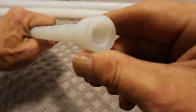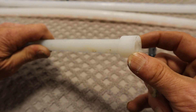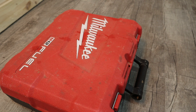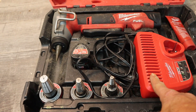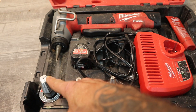You take the ring and push it on until it seats inside there. You can see where the pipe is bumped in — that is your crimp ring, but we're not using a crimper. Now there are different companies that make these tools — your Uponor guns or PEX tools. In this case we're working with Milwaukee. Inside the kit you have a rechargeable battery and three different heads: half inch, three quarter, and one inch — a basic residential setup.